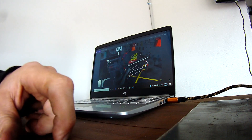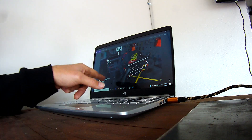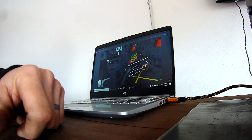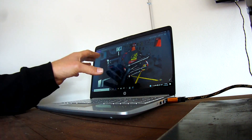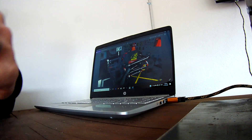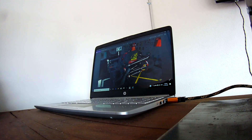Let's have a look at the next setup. Here we've got a go-kart sitting on rollers — it's like a mini version of the car example we saw at the start. These versions go away from using an inertia wheel and put a load on the engine by either using a hydraulic circuit or a water brake, so it's still something the engine has to work against. The torque is worked out by how much work the engine has to do against that water or hydraulic fluid. That's probably the way we're going to go, so we need to scratch our heads and come up with a design.